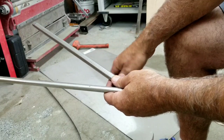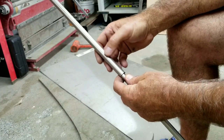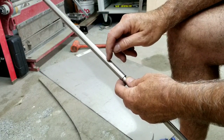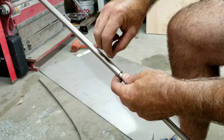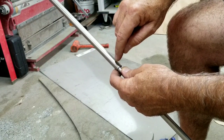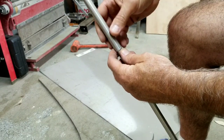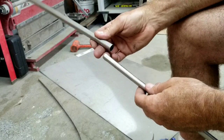I don't know if I'll be able to make it with that sheet metal, but I'll try. I'll make that little latch thing that goes here - it just has a little spring underneath it, and then it has two little flaps that flip up right here. So I'm going to make an incision this way, one here, one there. Those parts will kind of flap up so the other piece will have a part to bite on, and then there's a little pin on the end. It goes into a hole that goes all the way through both of these, so that locks it in place when it's spring-loaded.